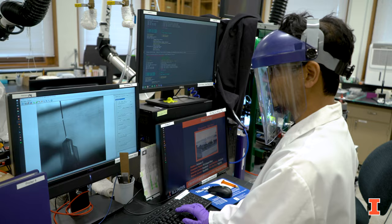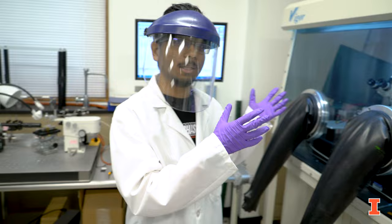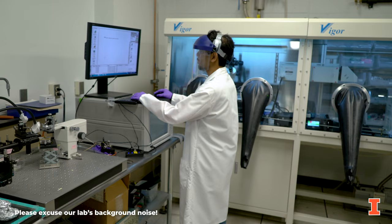Once we print the electrodes, we move on to the final stage: making electronic measurements to test the performance of our device. We do that in our probe station here, which is placed inside our glove box. Since most of the materials we use are sensitive to atmospheric gases, it's important to make these measurements in an environment without external interference. We also have a solar simulator inside the glove box, which we use to simulate sunlight with its specific spectral composition and wavelengths.